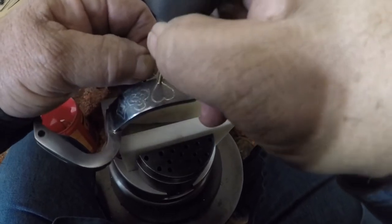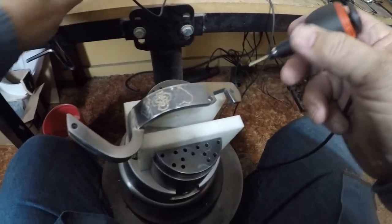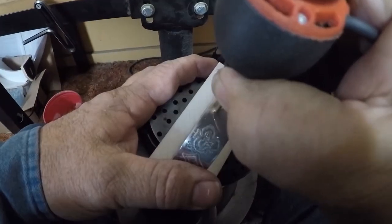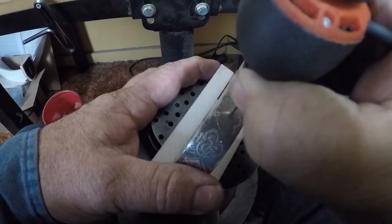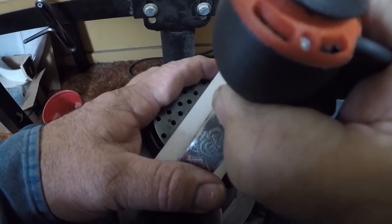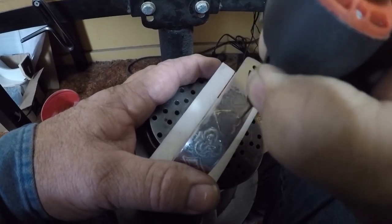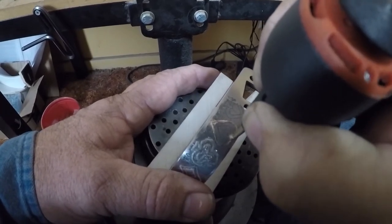This particular inlaid band has an outer inlay and an inner inlay. I've transferred the design on here with some transfer methods I use — I'll do a later video on that. Here I'm going over the whole heart design, trying to get it all smoothed down nice. It'll overrun the channel as you hammer it in, but that'll all be sanded off when you get to that point. You can see the other inlays look like a real mess, but they're just hammered down into those channels.